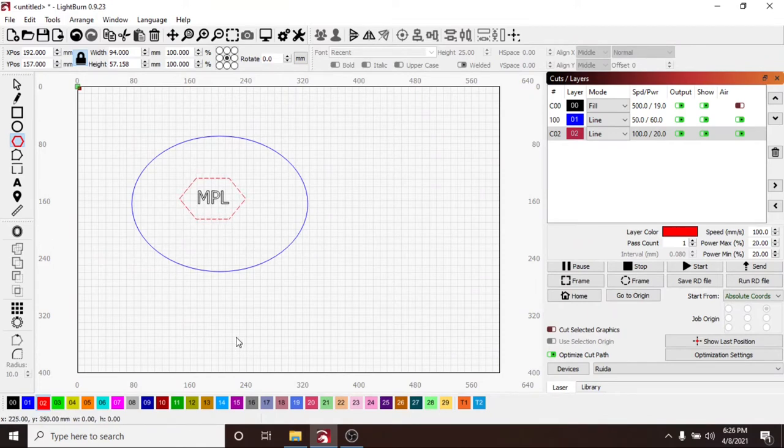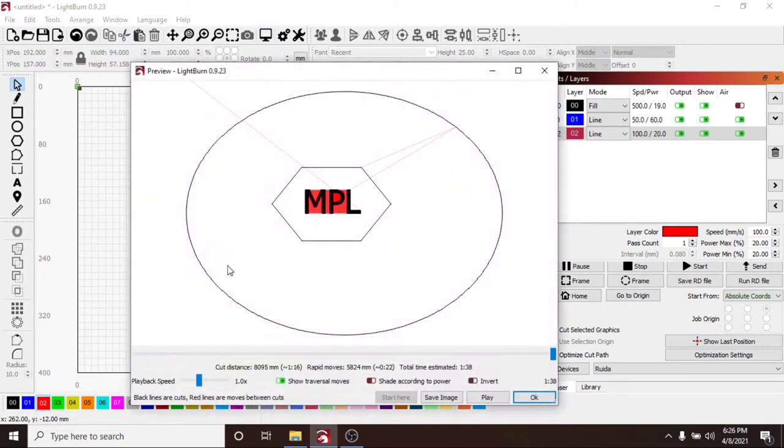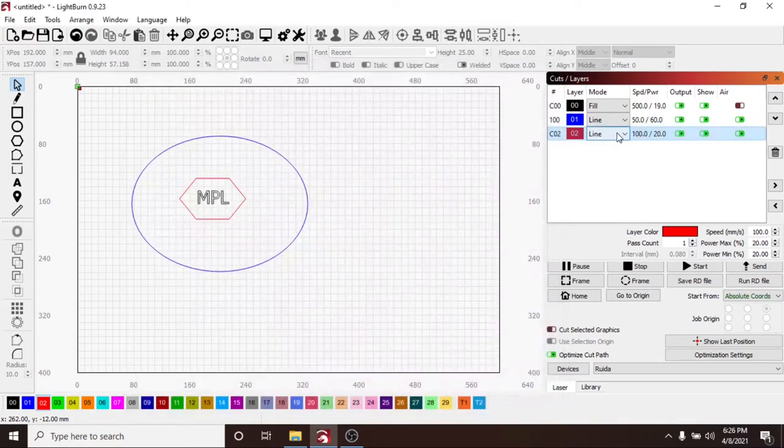We can actually see what that looks like if we click there, and then we'll click on the preview function right there. So that's actually gonna cut that shape out as well if we add that. And as you can see, the speed is 100 and the power is actually at 20. So we'd probably want to increase that if we wanted to cut this shape out of this circular material stock that we cut out from the larger stock. If we didn't increase the power, basically if we keep it at 20%, that's just gonna basically etch this line into the material. So if we change this over to fill, you can see what that's gonna look like